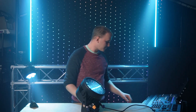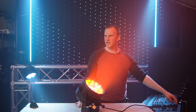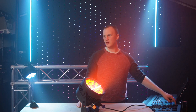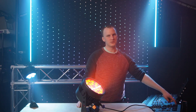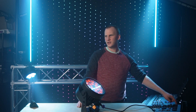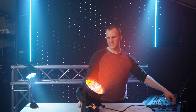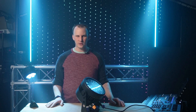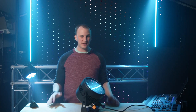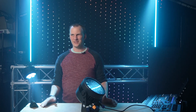In terms of dimming — let's bring it to amber and go back to intensity. It dims pretty nicely. Giving it a slow manual dim down on the console, at about 10% you see a little bit of steppiness at the bottom, like pretty much any LED fixture. But overall it dims pretty nicely — especially for a fixture that, when compared to others of similar brightness and build quality, really knocks them out of the park.